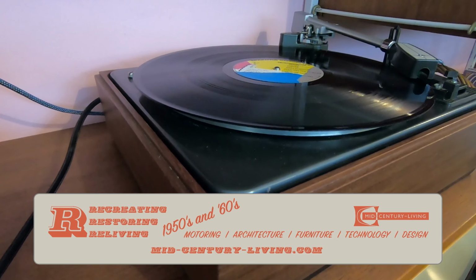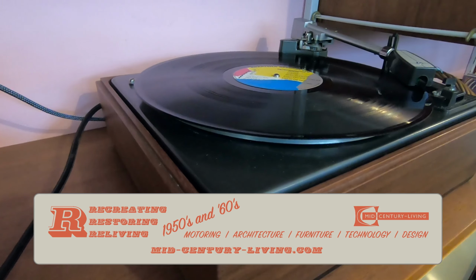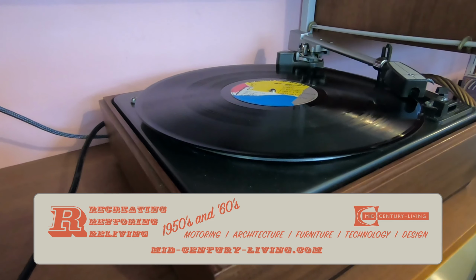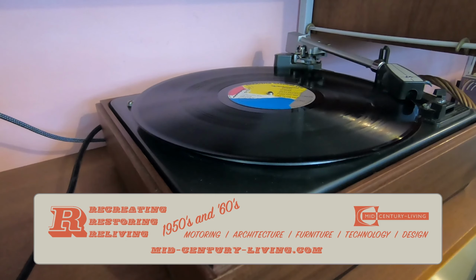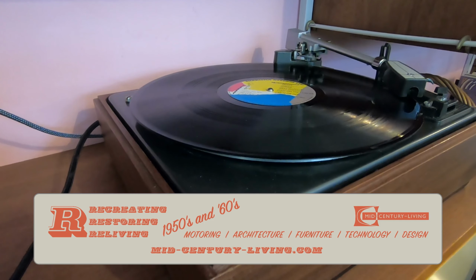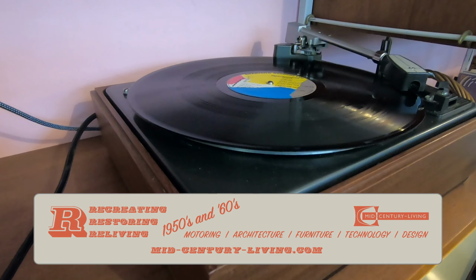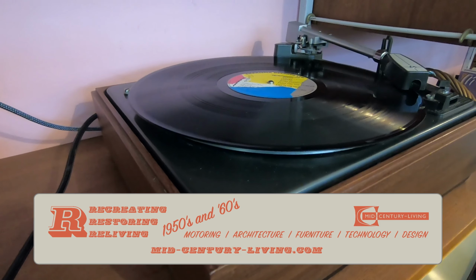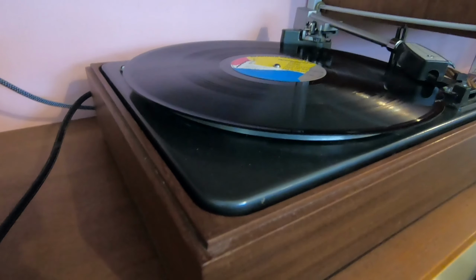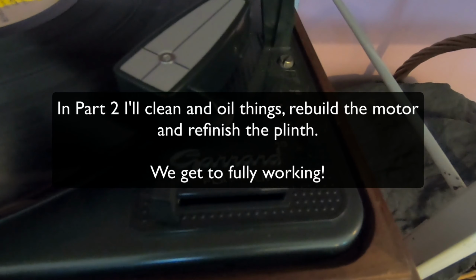I was just listening to the record a little bit. I think it's running a bit slow. It doesn't vary speed. It doesn't feel like there's any wow and flutter, but it feels like it's definitely running slow. So I don't know if that's just grease, and there was no real grease on the turntable spindle and the bearing. So I think all that needs cleaning and re-greasing, and then we'll see how it runs when I've done that. So more work to do, but yeah, at least it is kind of working.